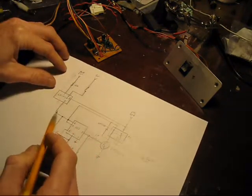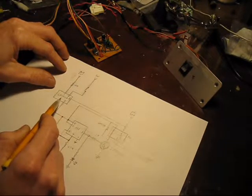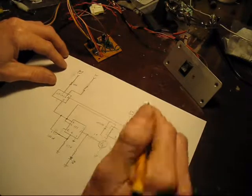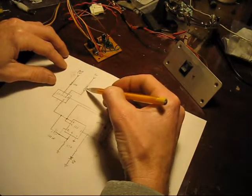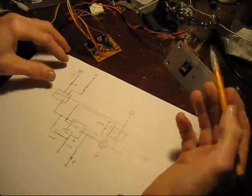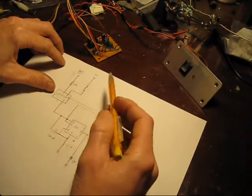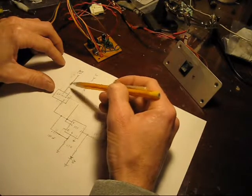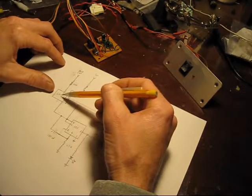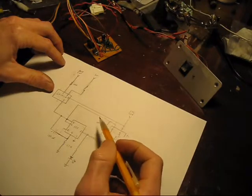There are a few different components in this circuit. We have an LH1511B — a solid state normally closed relay — a 555 timer, and then a regular relay with some associated circuitry. The five volt power comes in through a main power switch, which just allows me to kill power to this module if needed. It then goes into the relay, which is controlled directly by the power being sent to the power light. Because it's normally closed, anytime the power light is on this relay is off, and anytime the power light is off this relay is on, sending power to the rest of the circuit.